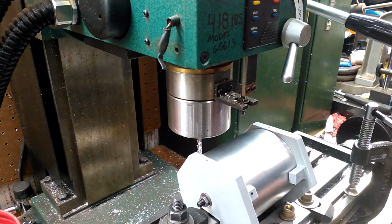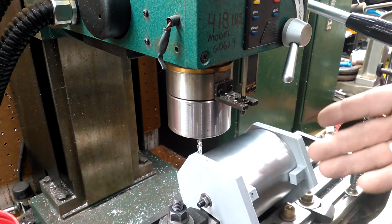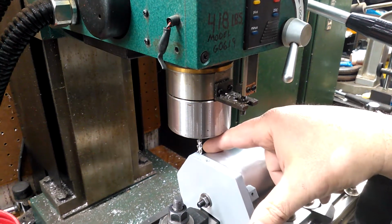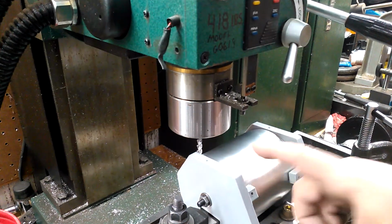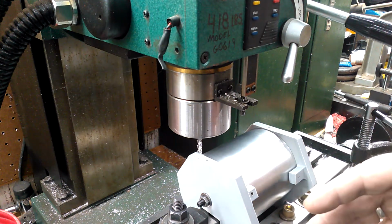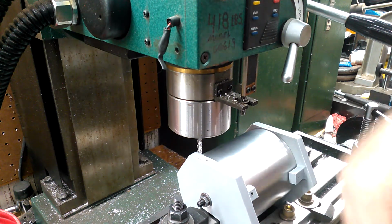Oh, by the way, 1/4 inch end mill, high helix 2 flute. I'm running at 1800 RPMs, which is the maximum that my machine runs, and no cutting fluid. When you start into here, you want to start slow, and then as I traverse across here, I will speed up my feed rate about 2 revolutions, or about 1 revolution every 2 seconds of the turn.